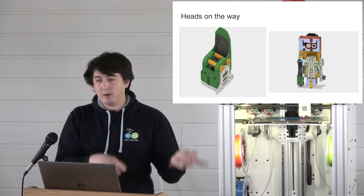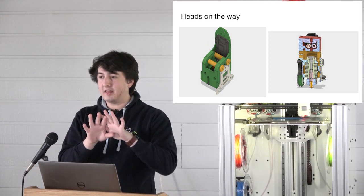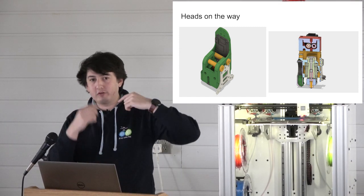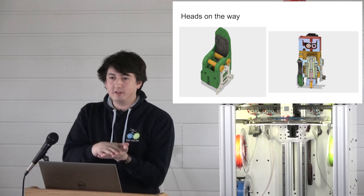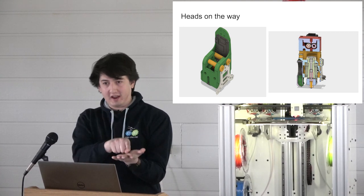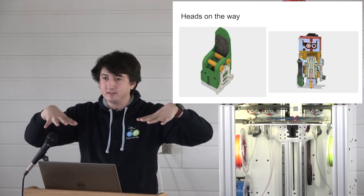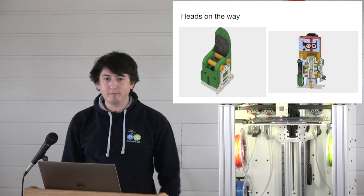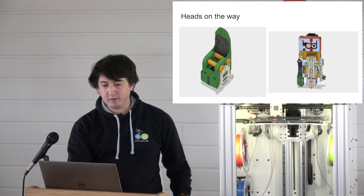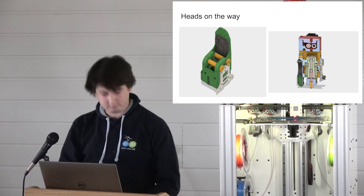The Raspberry Pi then uploads those to a server. A Python script runs, stitches them all together, and then once you've got the full print, the Python script runs it through FFmpeg, which means you get a full video of your part being built, not from the side, but like you can see your infill being built and that everything is in place and correct. So yeah, that's cool, and obviously a bit of OpenCV combined with that, and you're laughing. But that's Tony's problem, not mine, thankfully.